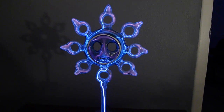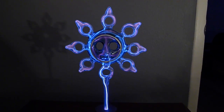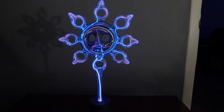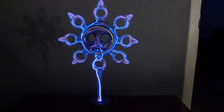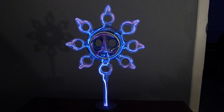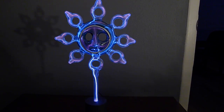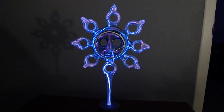The gas in here is 320 torr, comprising 20 millitorr of iodine and 10 torr of xenon, and the balance is neon gas.